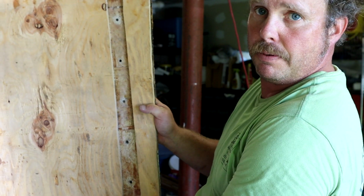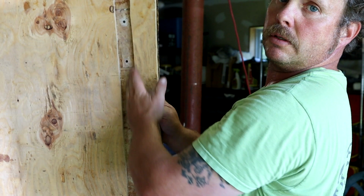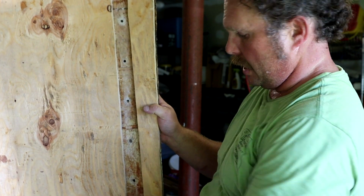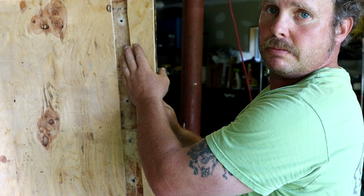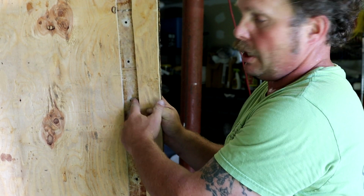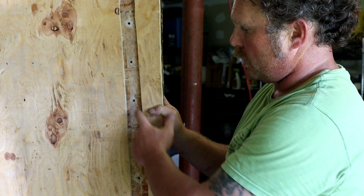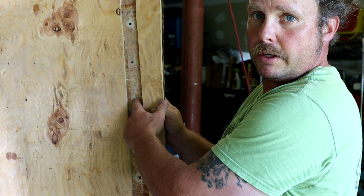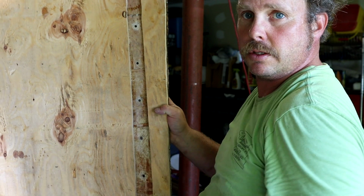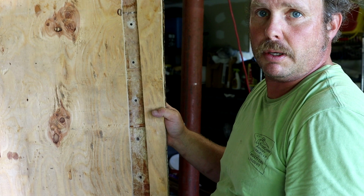I'm going to lay this up with fiberglass tape a 1/2 inch thick in this whole area. So I'll sand it and layer this in with fiberglass tape. So this should be good and solid, and once again, like the other areas of the boat from previous videos, it should not be an opportunity for water to get from these holes into the core. There's almost an inch away all the way around.